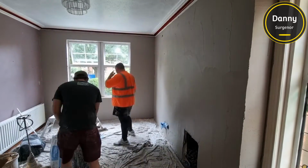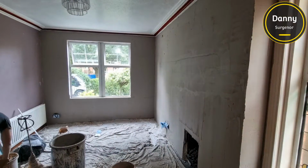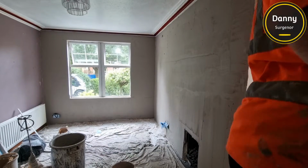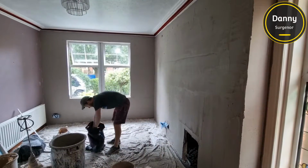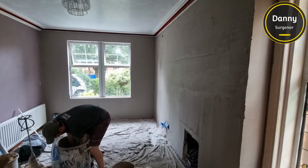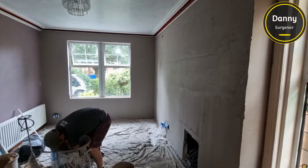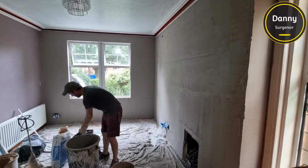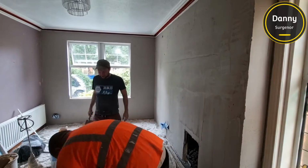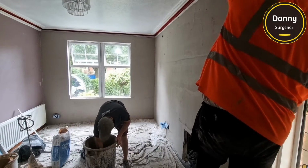Yeah, so we're coming to the end now, and you'll see the next clip. You can see I've pulled the speed skim over the top of it, and it's super dry. And because of this, I'm actually going straight to my cutting. You can see there the bucket's only being cleaned out, and the stuff is rock solid. Almost to the point of being unworkable, but just not quite there. Lucky enough, flattening it in with that speed skim did a lot to save me here on this job.